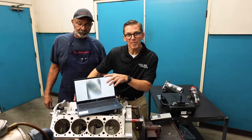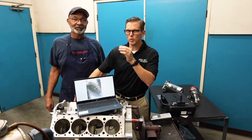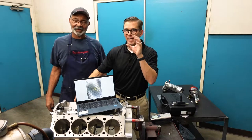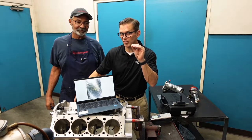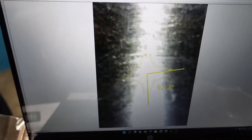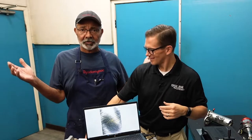It's truly amazing. There's a little blob thing in the background that basically tells you how sharp it is. So if it's really scattered, it's going to be more of a big giant blob shape. If it's actually a pretty tight, very defined crosshatch, it's going to be more of a star shape. So it really lets you see what it is — that's why it's called HatchView, crosshatch view. It's a microscope for bores.